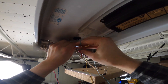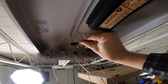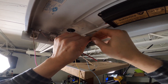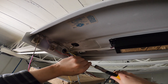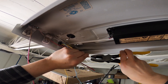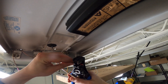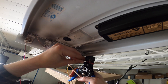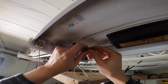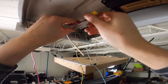Here are our hots — we have three: this tombstone, this tombstone, and this tombstone. Confirming that our lefts are our neutrals. I'm going to take my lineman's tool and just twist these together. Here are my hots. I'm going to take my supply line — it's 12 gauge. I'll strip that and take a wire nut, put that in and twist it. I kind of absolutely hate wire nuts but for this application it's okay.